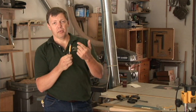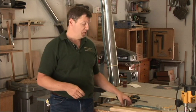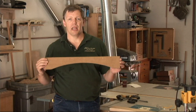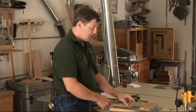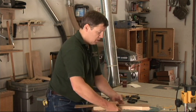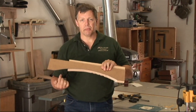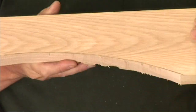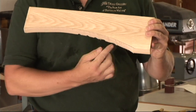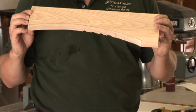The difference between the two essentially is which side of your work your pattern goes on. The first thing we're going to do is make our pattern or template. I've got a template here — a simple curve that I use on a lot of the aprons of my furniture. I'm going to line it up so that my ends and bottom are square to the stock, draw a line on my material, then take it to my band saw and cut just outside the line, trying not to leave much more than a sixteenth of an inch or so of waste.